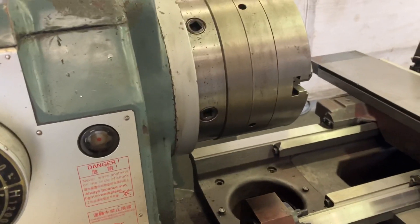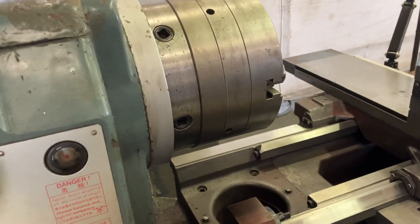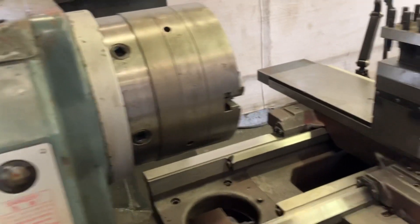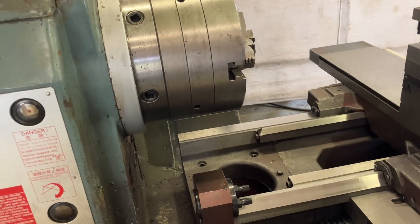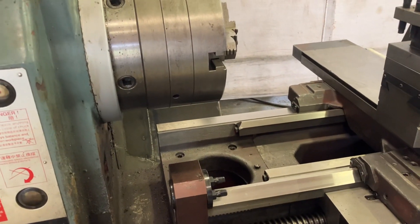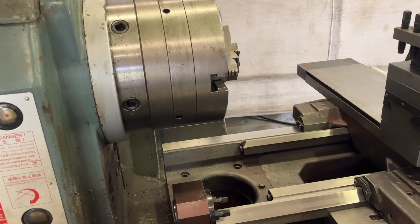When it's running, it's beautiful. I'm assuming if you put load on it — meaning you had a part and you're taking a cut — you hear nothing? You put load on it? Yeah. It's still quiet as can be, because when you put load on it, you're really engaging the faces. It's only when you've got no load, free floating, that you get a little noise — and that's probably just the deceleration aspect.